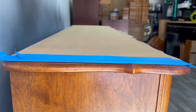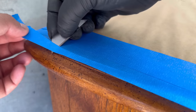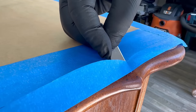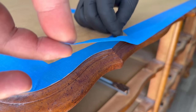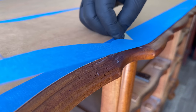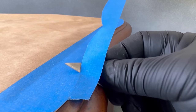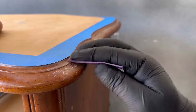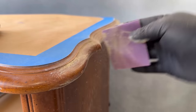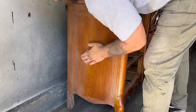One of my favorite parts is masking off the top — adding all the tape and then using a razor knife to cut all the excess off to get a nice crispy line. One tip: I don't cut all the way up to the edge. I cut it angled toward the top so it leaves a little bit of natural wood exposed, allowing me to come back at the end and sand off any small paint overlap. Going right to the edge can leave an old brown finish showing that you can't easily remove.